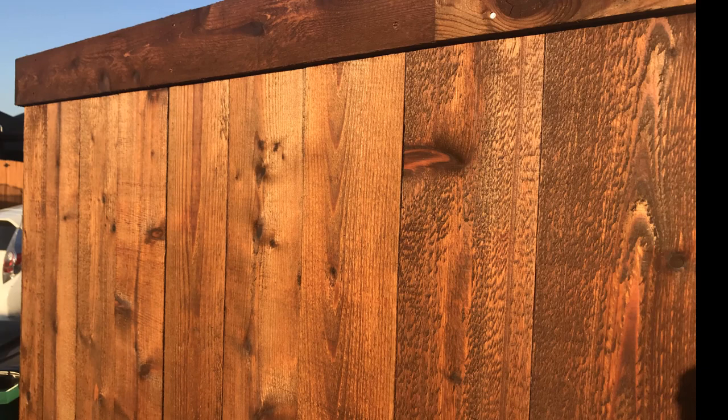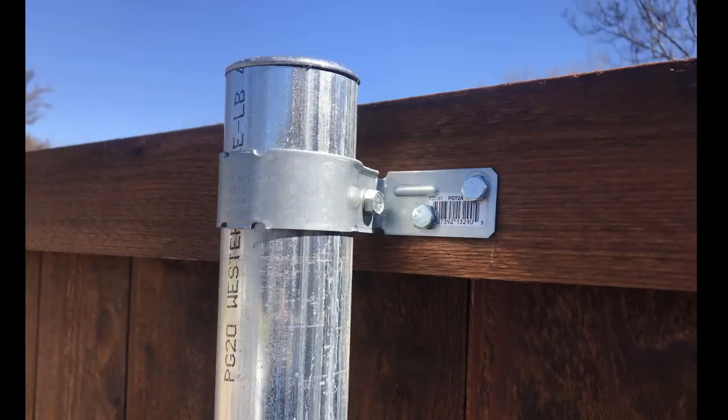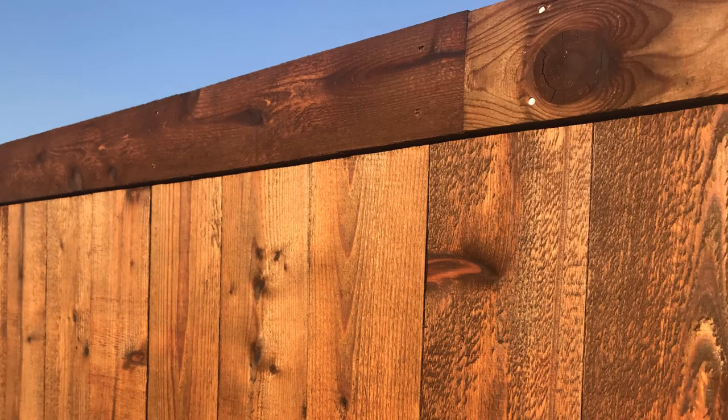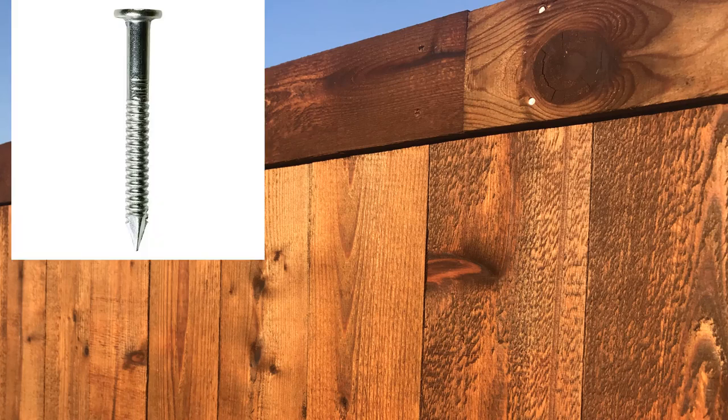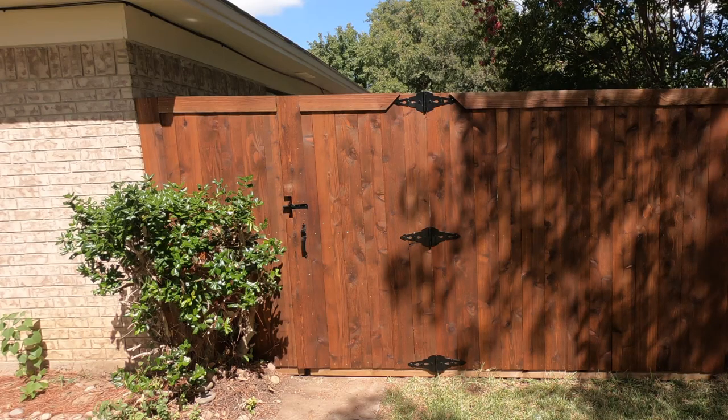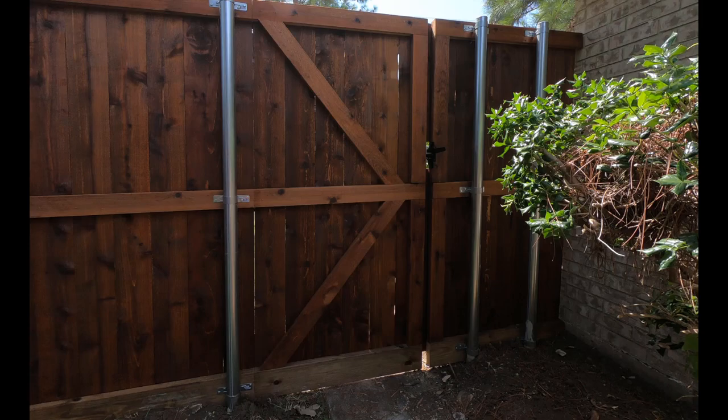Let's jump to the pretty side quickly. Those are 1x6 pickets, side by side, and then across the top is a 1x4 cedar board we call top side trim. Not only is it pretty, but it's got a job. The heavy-duty steel post, the Simpson bracket bolted to that 2x4 cedar nailer — that and the top side trim squish those pickets, keeping them straight, flat and true, all held in place by stainless steel ring-shanked nails. They will not degrade; you will not have black coming out of the nail holes. Throw in a no-sag gate front and back, and there you have it.